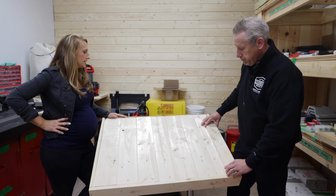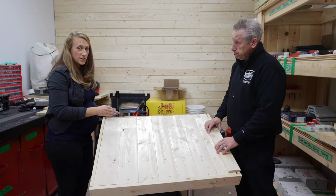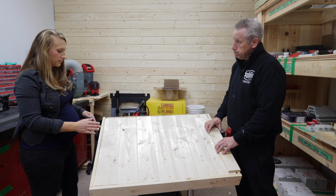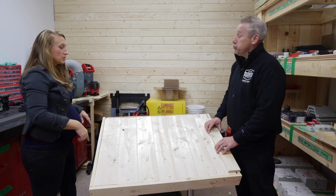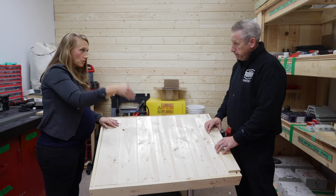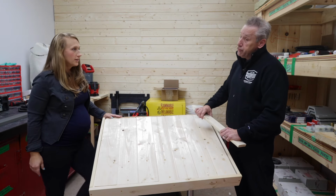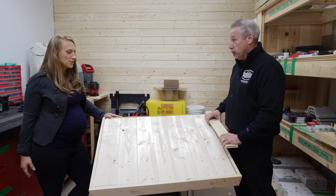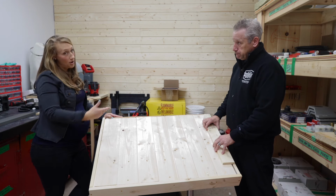Yeah, and ideally, we tell our clients that as best as they can, if they have to shift it a little bit for the 2 feet rule, they want to be anchoring these into their roof beams. So if their roof beams are running this way, we want to make sure you're not just in the roof boards, you're also in those roof beams, which are bulky. The strapping is holding the roof down. So you've got to make sure it's on really good and secure. If it's not a perfect 2 feet, we'd rather you hit the roof beam than not hit the roof beam.